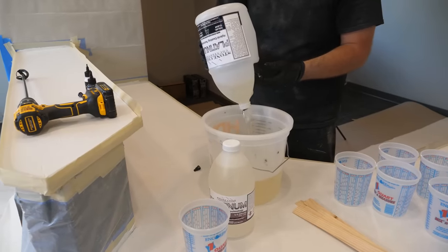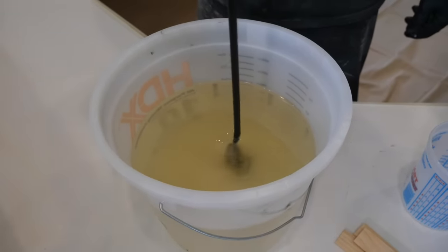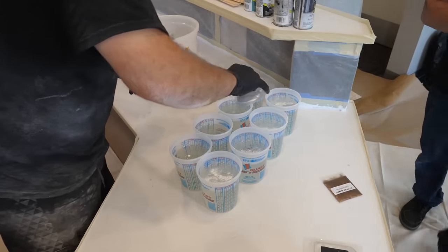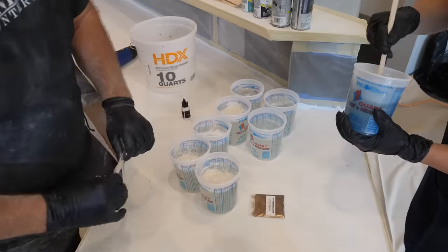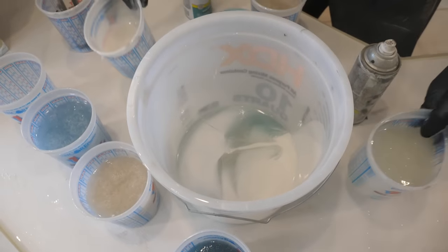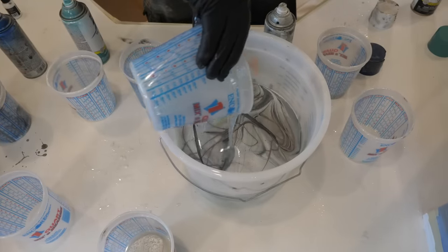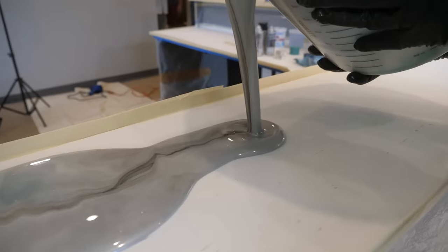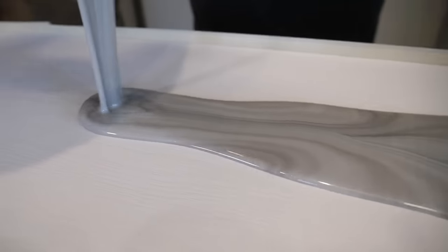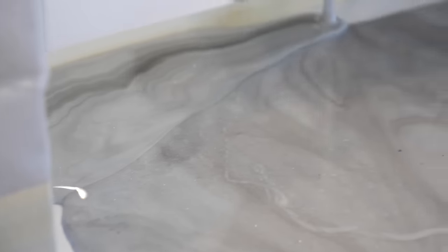This is a two-to-one ratio — twice the amount of resin versus hardener. In a large mass in the bucket, Stone Coat Platinum will have a yellow tint. Don't be alarmed — this is an absolute non-yellowing hybrid coating technology perfect for light and white countertops. When you pour it thin, it will be crystal clear, color fast, and won't yellow even in the sun. We're prepping this project as an exotic pour, with metallics and dyes in individual buckets being added back into the larger bucket. Remember, Stone Coat Platinum is for folks with epoxy experience — you need to move quickly, as it starts to set up in about 15 minutes. Only mix as much as you can manage in that timeline.